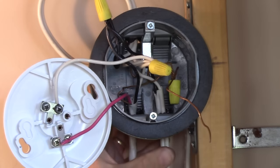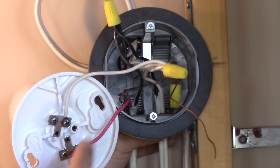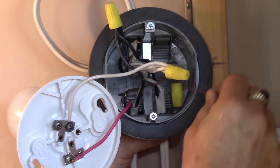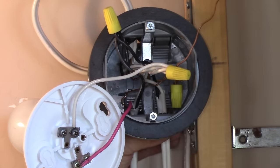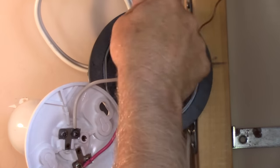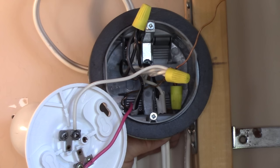Here's the difference in splices with the three-wire. We have our incoming neutral — the cable has a hot and a neutral in it. The incoming white gets spliced to the outgoing white to the rest of the circuit, as well as a pigtail to our light fixture, our plastic chandelier. Now there's also a neutral going down to the switch. Grounds are all done properly around the ground terminal in the outlet box, spliced together with a pigtail for a future light. Neutrals are all together including a pigtail to the light fixture. Power in, power out, and now power down to the switch on the black wire — so we have all blacks together, no more need to identify a white as a hot. All three blacks are together, and then the returning red from that switch goes to our plastic chandelier or any other light fixture.